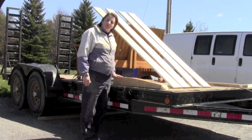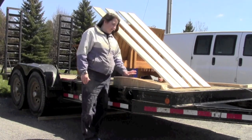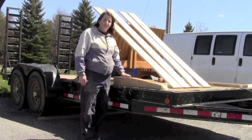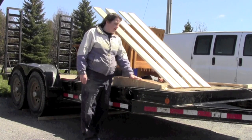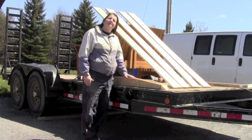We're making arms today. This is the form I use to make my arms. It's made out of six pieces of half-inch MDF cut to the exact same size using my router and then glued and screwed together, covered with packing tape so that when the arms are made they do not stick to the form.